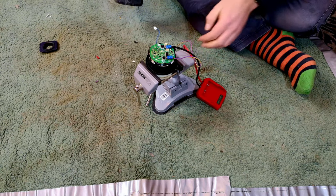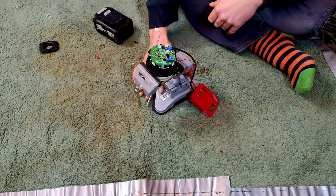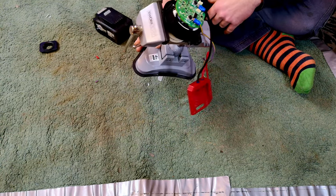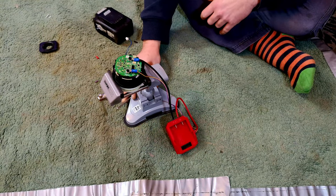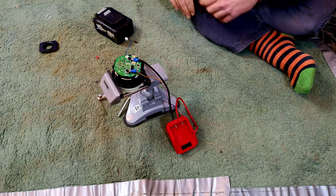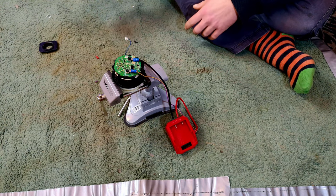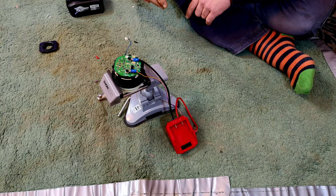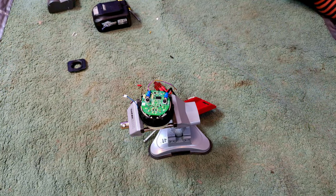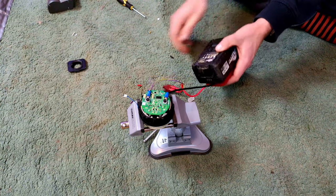Oh yes, look at that - it's on fire! Dang it, well that didn't work. It's all very hot. Okay, it seems that you cannot direct-voltage a Dyson motor, which is a bit of a shame. Obviously these batteries give out 20 volts and it takes 21.6, but it seems if you put it straight to it, it doesn't work. Oh well, that's a shame. I guess it does help, though, if you connect the terminals properly. Problem is - has this completely goosed it?